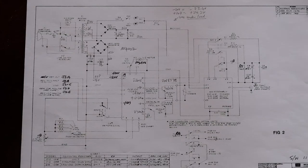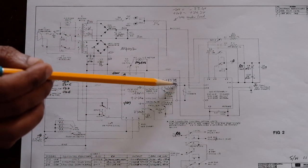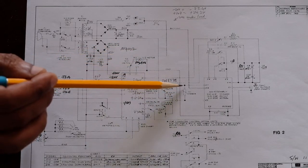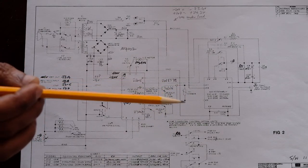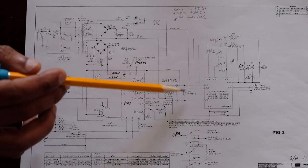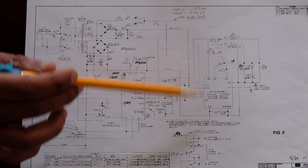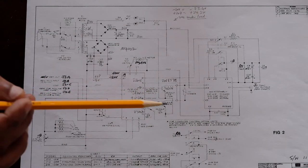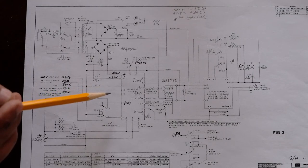At this point I reconnected the two driver supply connections to the transistors that I had disconnected earlier during debugging to prevent noise. Those disconnected outputs were to the HV unit, because the transistors were making a lot of noise probably saturating the flyback transformer by running at 60 Hz rather than at the correct higher frequency. So that's what I'll show next.